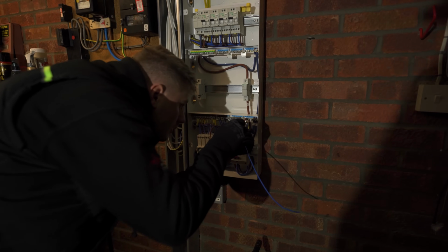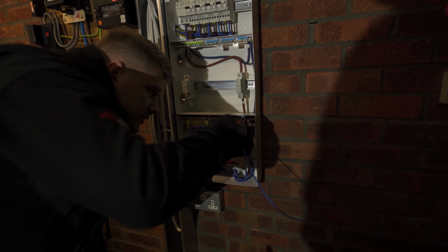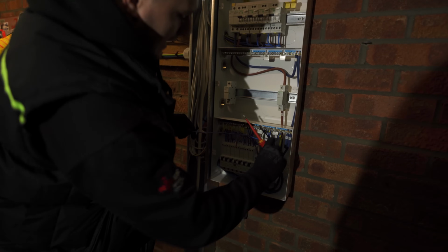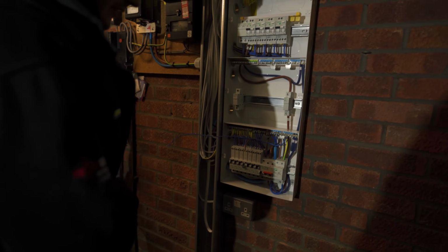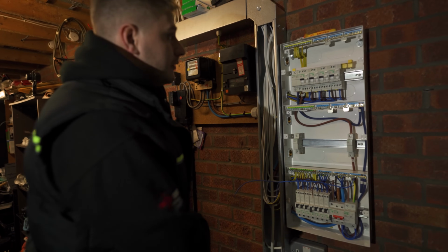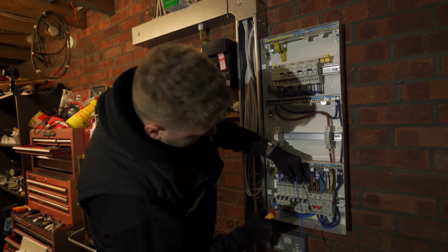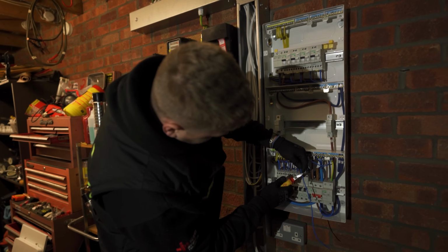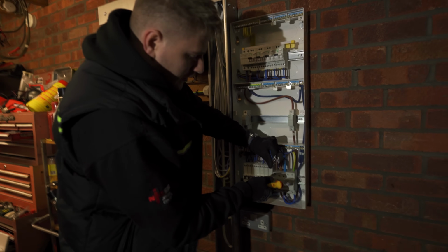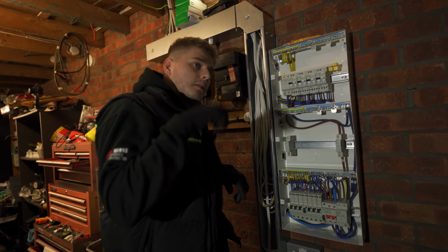So that boiler then, you reckon it's coming out the ground floor sockets? No, I think the boiler, you have a spur for a boiler, don't you? Yeah. And then it happens all the time on old houses, and that's in the kitchen, tends to be. And then the wiring centre for everything tends to be in the airing cupboard. So back in the day when they used to wire houses and RCDs weren't a thing, which clearly by your lack of RCDs, this was an older house, they've put the boiler in the kitchen. Oh, let's put a spur on the kitchen ring to feed the boiler.